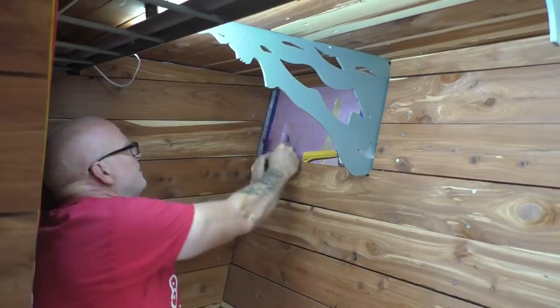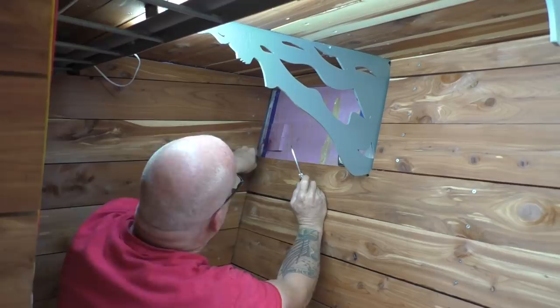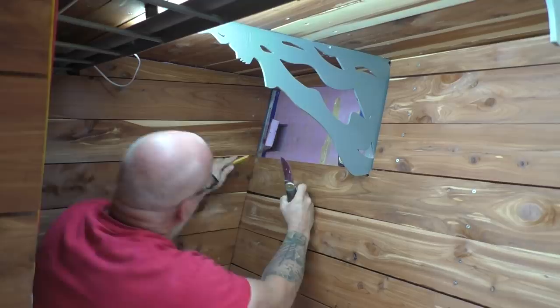There's two inches of foam insulation in here. I just have to make little wedge cuts and I can put it back in when I'm done. I've got to cut all the glue because we sealed it really well so that no air can get back into the hull — no air, no condensation, no water collection, no rust.